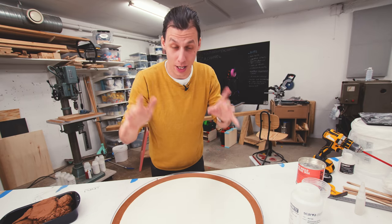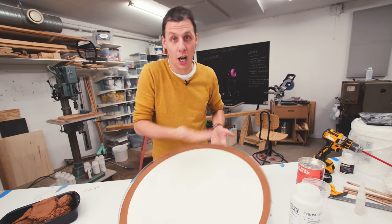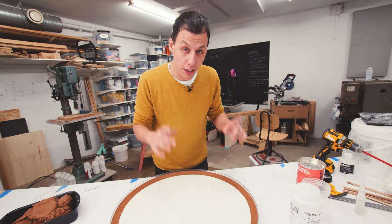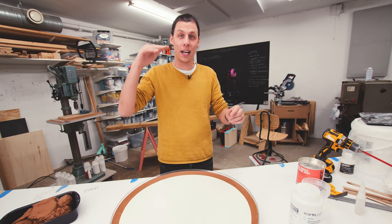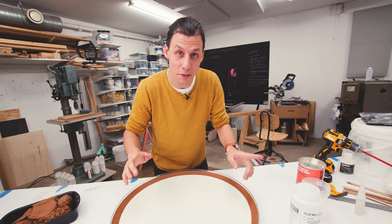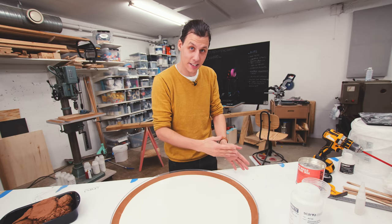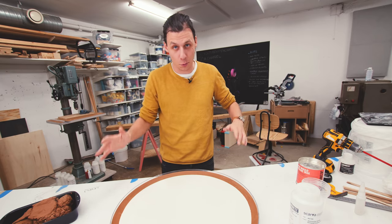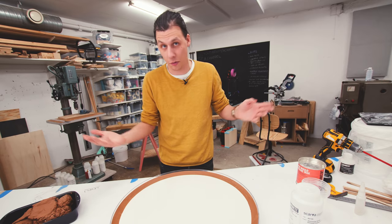One quick thing to note about the way I made this mold: it's constructed so that this surface will be the underside of the finished part. Normally you'd have it the other way around, where this surface ends up facing up, because usually the bottom against the mold surface turns out much nicer. But if I did that I'd have to make a mold with the chamfer on the opposite side, so I figured it's less work to just sand the top nice and flat than to try to make a super fancy mold.